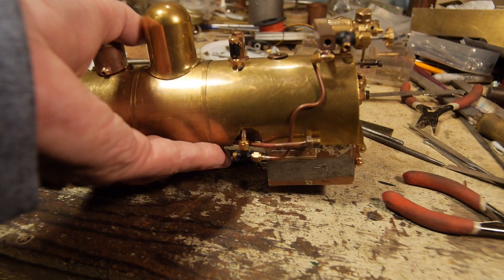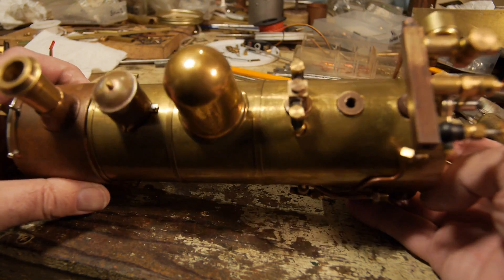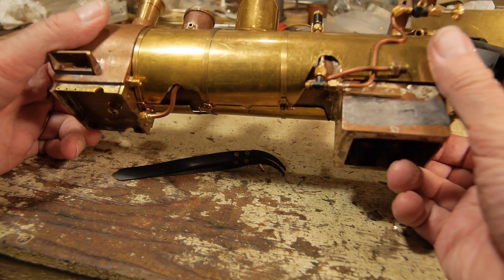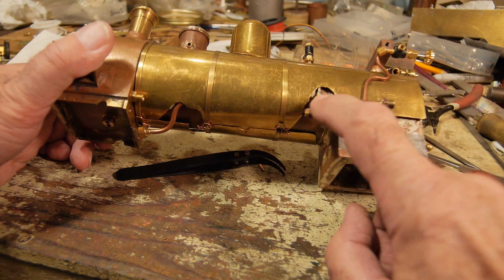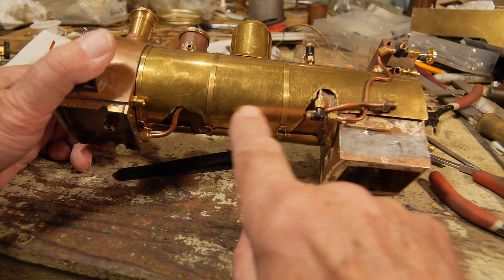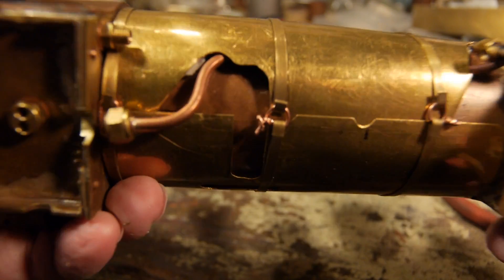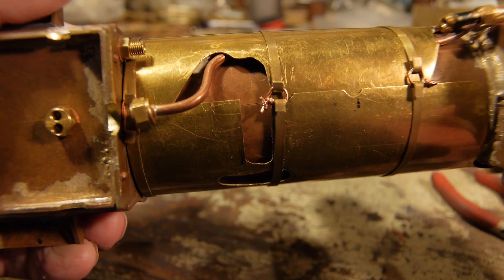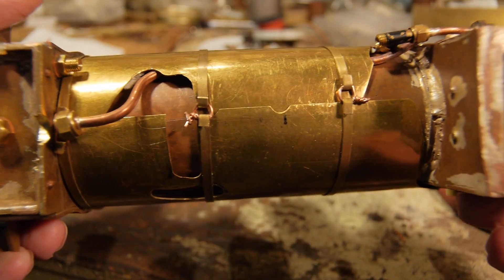Here's the boiler. It's looking quite neat now - I've got the cladding on it. I'm going to assemble it in a way that I'm ready for steaming. See the way the pipework shoves underneath the cladding here. This was the main steam pipe. I clipped it off here so I could connect it to the cylinders and pre-thread it underneath the cladding. The bands are strips of brass - fold the ends over and use a little twist of wire to hold them together. That's what's holding this cladding around the boiler.